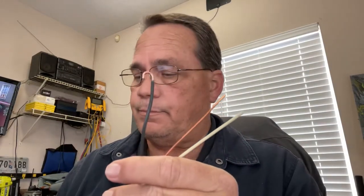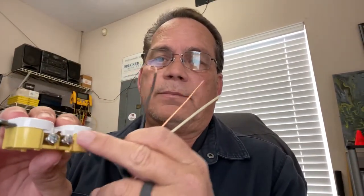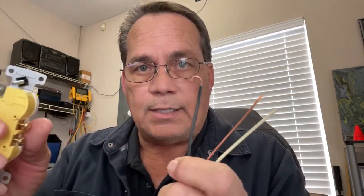Then all you want to do is grab the tip of that wire and put your little turn on it — just like that. You want it to go clockwise. And why? Well, when you wire into the screws on this outlet, you want those wires to go clockwise with the way the screw turns.